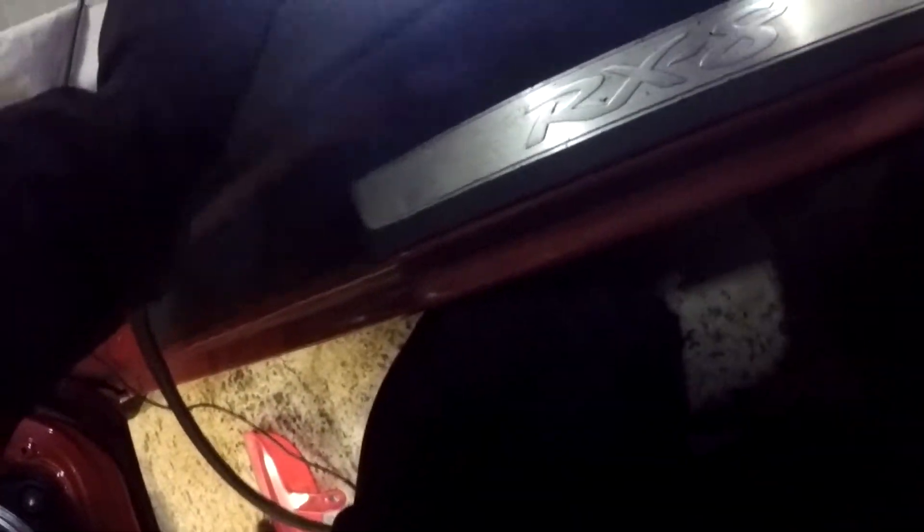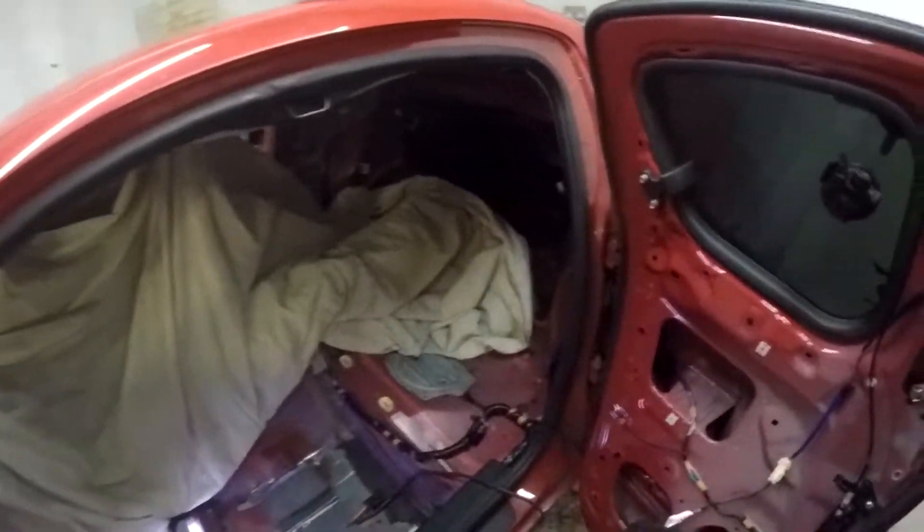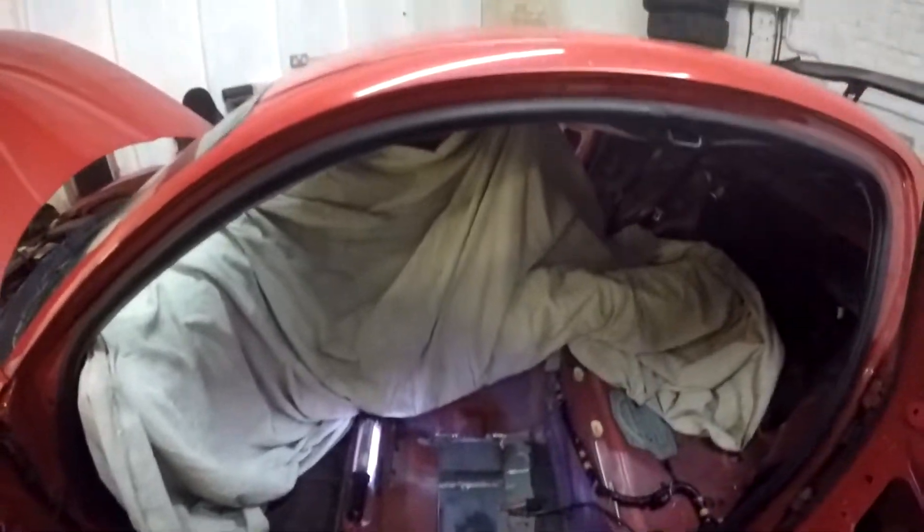Check it's not on fire underneath — hands not on fire, that's good. That's not pretty. I wasn't really maintaining contact with it there, but it'll hold. Now that is a hot spicy meatball. Got a bit of ventilation in here because the fumes from welding — maybe these fumes aren't good for me. Here I was saying that I couldn't bead weld, but turns out on two mil thick stuff I can. This one mil thick stuff I can't — or under one mil.